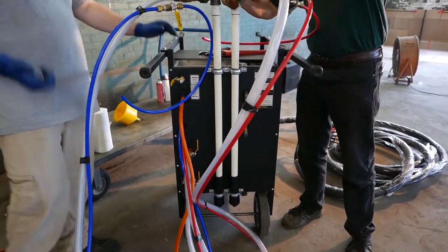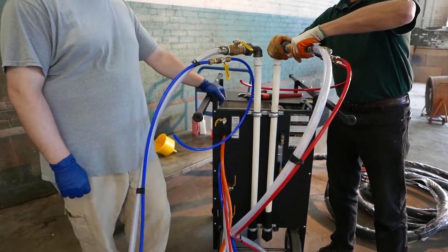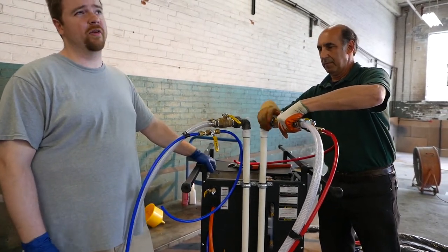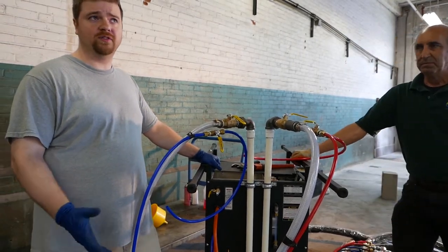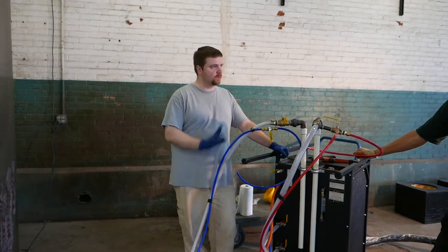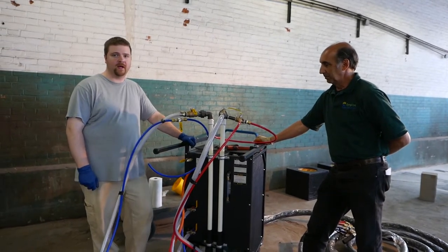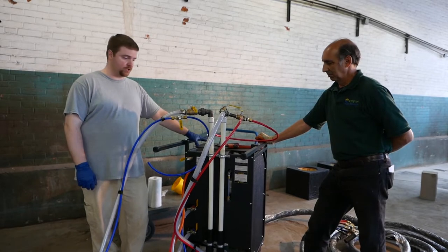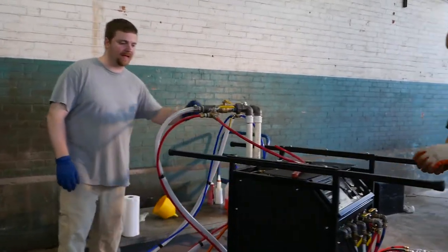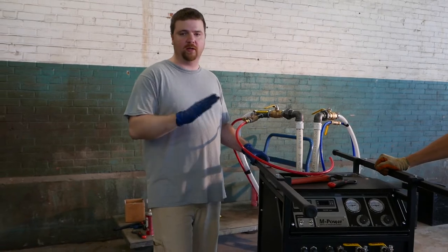The whole machine, filled with heating fluid and material, weighs about 240 pounds without the hose. A 50-foot hose with gun assembly is roughly 60 pounds; a 100-foot hose with gun is approximately 90–95 pounds — much lighter than many higher-pressure systems. This is a medium-pressure machine capped at 400 PSI, internally regulated so each pump shuts off at 400 PSI and won't restart until pressure drops to 300 PSI, preventing pressure surging.